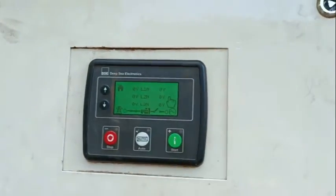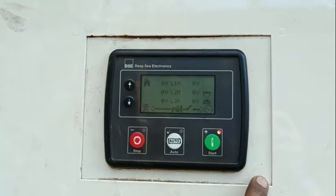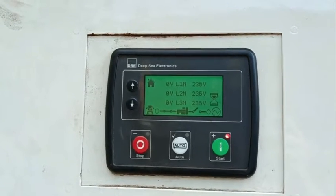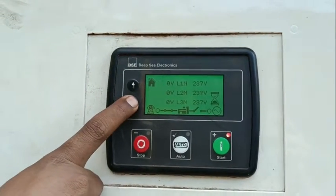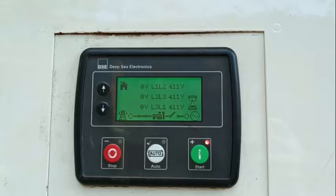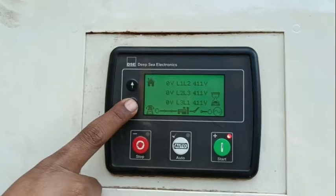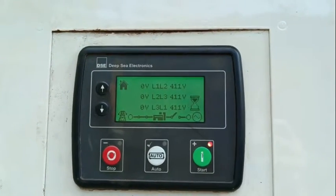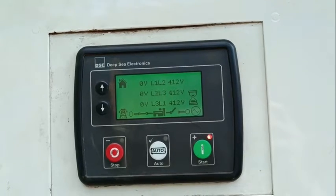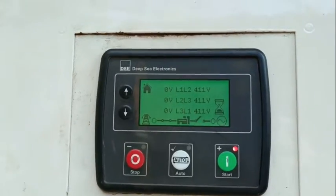Now I am going to start the alternator. When we connect all the system and start the alternator, we will see a voltage build-up. If all the criteria are met and we bypass the AVR, we should get our desired output. Here you can see we are getting the desired output, which proves there is no problem with the alternator. I hope you liked the video. If there are any issues or questions, please comment below. Thanks for watching — have a good day.